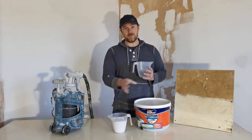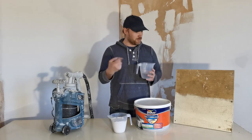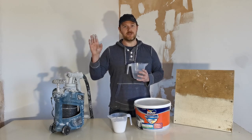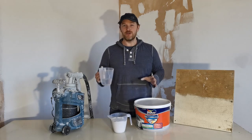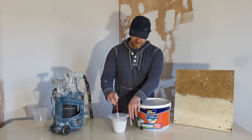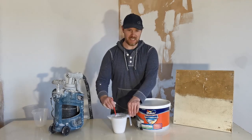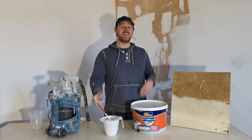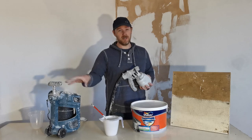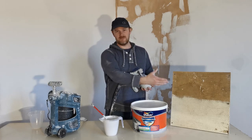If you're buying a big 10 litre jug and it's two parts paint to one part water, put five litres of water in a bucket separately and use one of your big paddle mixers that you put in your drill. Get it as smooth as possible and it will come out like an absolute demon. That's the mix — when doing this properly you'd use a bucket and a bigger paddle mixer.